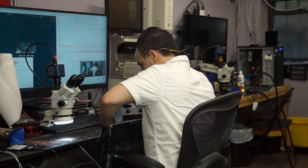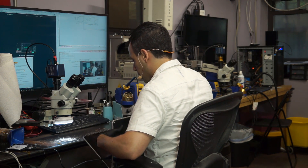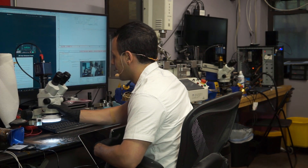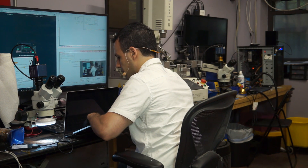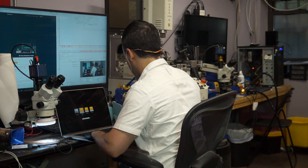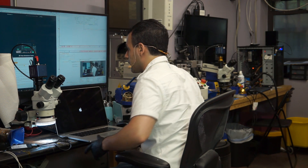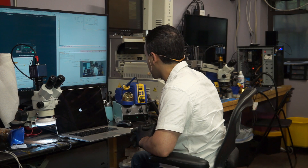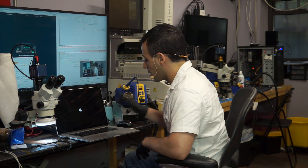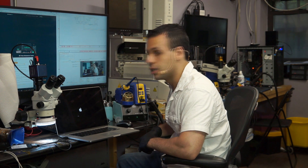The first thing I do is unplug the webcam, because the webcam is also often an ambient light sensor — it tells if there's a lot of light in the room. I don't feel like having to remember to cover it. If I don't cover it, the backlight won't come on. So we're going to boot into a test operating system and see what happens when I hit the backlight up and down keys on the keyboard.